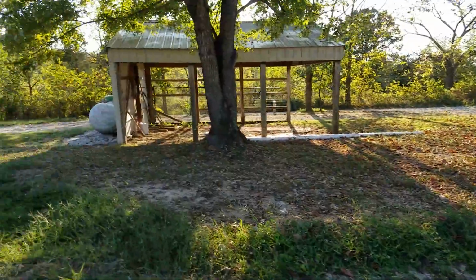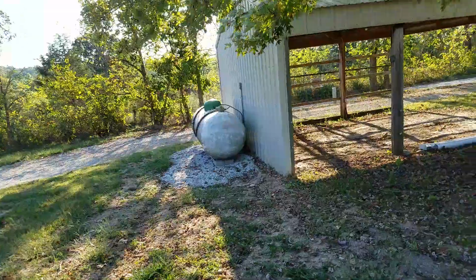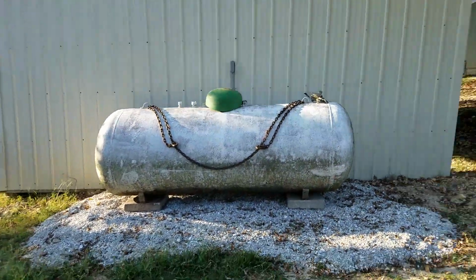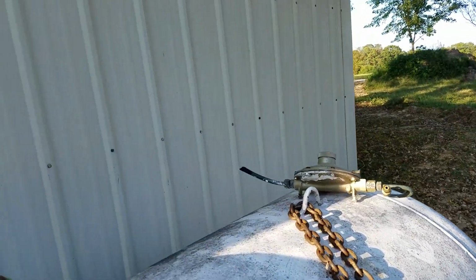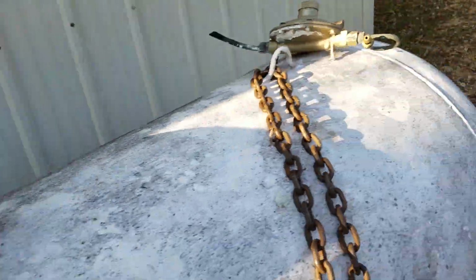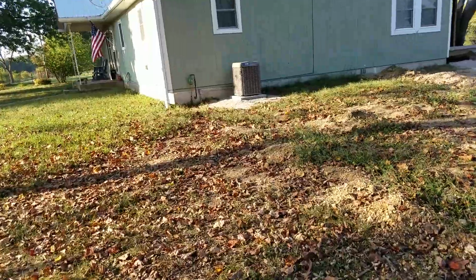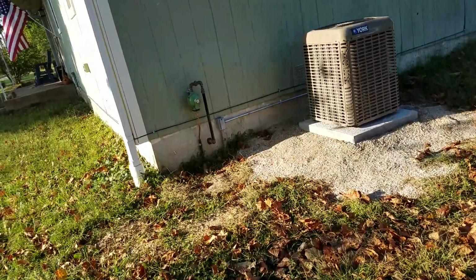Anyway, okay, propane tank. We moved that. All those trenches I had opened in the spring, that's what all this stuff was for. So, yeah, we moved that bad boy. So that's good. Behind the garage, out of the way. That regulator was a POS, so we got a new regulator. Boom. That's the high pressure regulator. I gotta get that chain before I leave. And here is the low pressure regulator. Brian and I did all this stuff under the house. We did 3/4 gas, threaded it, all that.